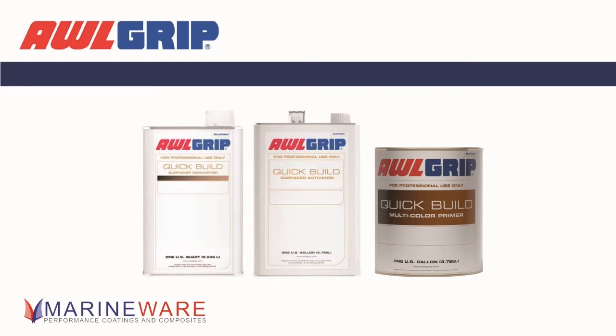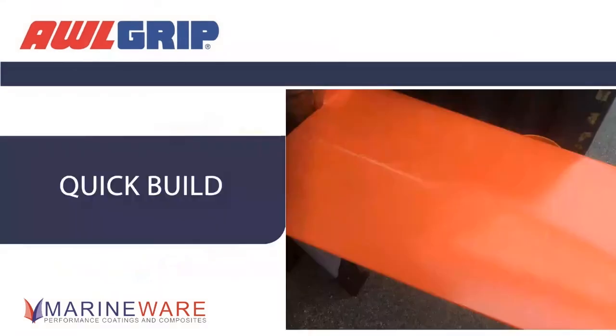We've got some examples here. This one is a rudder off one of the Volvo Ocean boats — Rich was lucky enough to follow the race for a year, helping with paint supply and repairs. For those of you that paint, this is an orange rudder. Orange has quite poor opacity. The beauty of this product is you can tint it different colours. What you can see, though it's quite difficult to see, is the original sanded gloss top coat in the middle versus the primed area around the outside — showing how close we can get to the top coat colour.